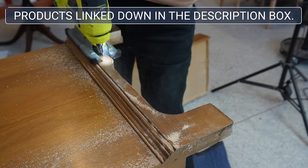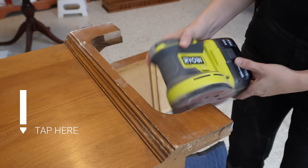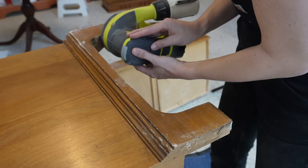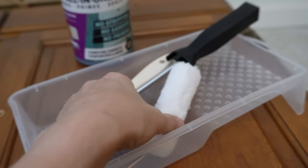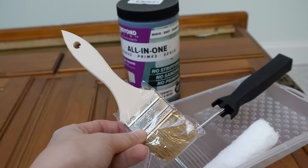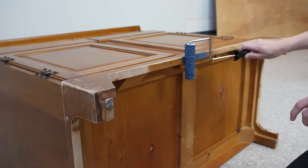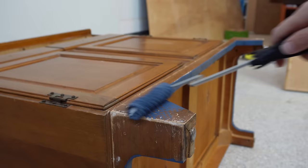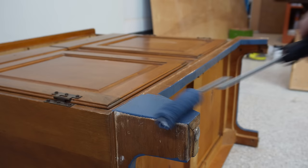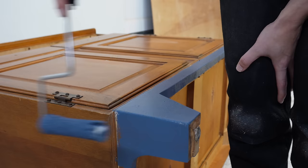All the products I'm using today will be linked in the description box, and anything available through YouTube Shopping — you can tap the view products button and they'll show up on the side of this video, or you can head to Lowe's and pick up the most popular colors of Beyond Paint there. All my prep is done and I'm ready to paint. Since I'm using Beyond Paint, I do not have to prime because this paint bonds directly to my finished surface. I have my Beyond Paint kit with my 3/8 inch microfiber roller and a chip brush. I'm pouring my paint into my paint tray and these are all the materials I need. I'm painting the base first with my furniture on its back because it's going to be a lot easier to hit all these spots. I'm using the chip brush to get into areas the roller can't reach, and then rolling everything flat. My favorite part about this paint is that it has the sealer built in, so after I put on my paint, my makeover is finished — I don't have to add an additional top coat.